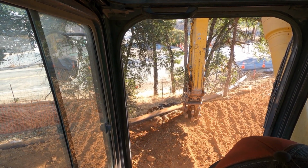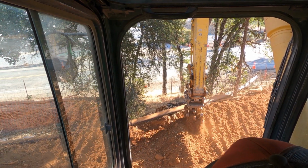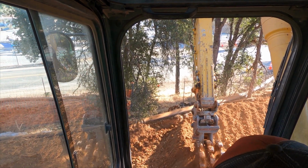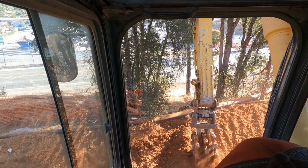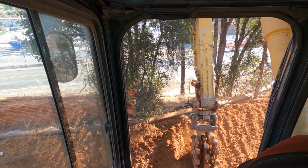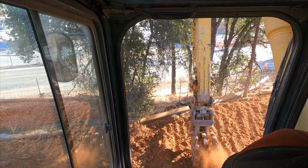As we progress through this and I start moving back the other direction, what you're going to see is I'm going to move in small increments. Most likely I move over one pad at a time, width-wise. I make fewer back and forth motions, and I'm getting a harder and better result out of my compaction effort and time that I put into it.